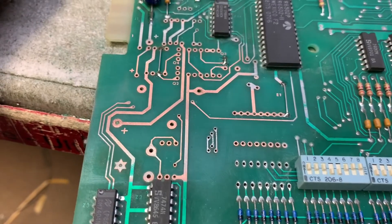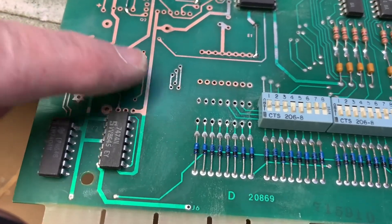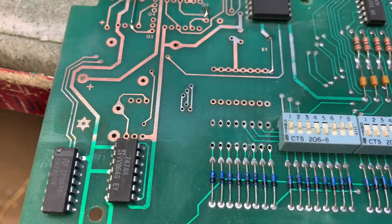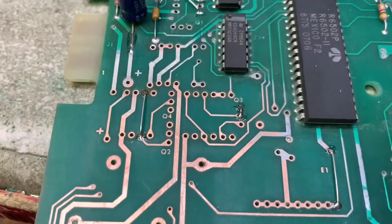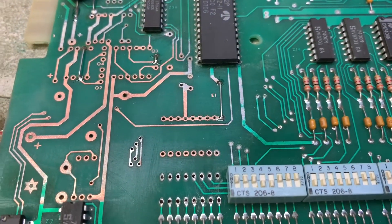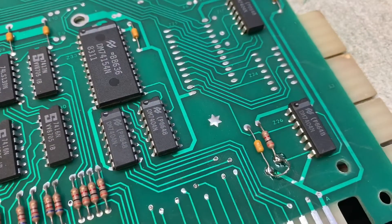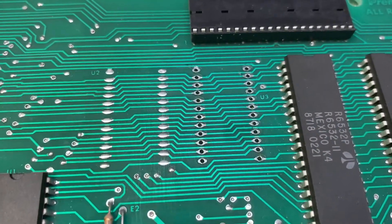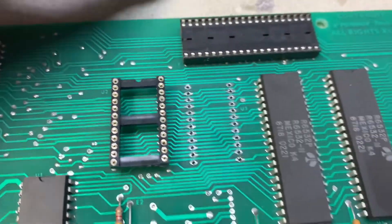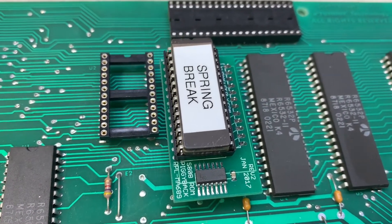Next task is to use the Hakko to suck all the solder out of these holes. I have all the parts removed and you can see I've sanded down to bare copper in most cases. I've cleaned out some critical vias — these six are important as they carry switch matrix information. I've added some jumpers I'm going to need when I put the Dallas Maxim reset generator on there, and I've replaced the E1 jumper. I've also added the slam switch mod and cleanly removed the U3 socket location.